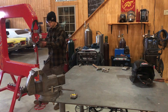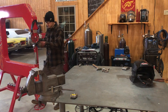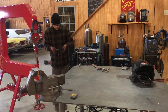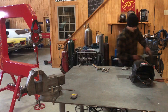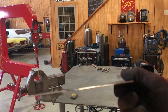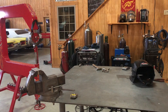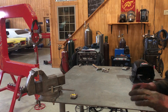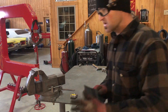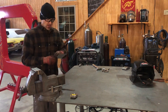The English wheel is doing the same thing as a hammer and dolly, it's just more even pressure. So that quick — as you can see, it's just hammered out. I'm not going to grind this one because it's pretty flat. I will before I go to the next step, but I just want to share this with you.